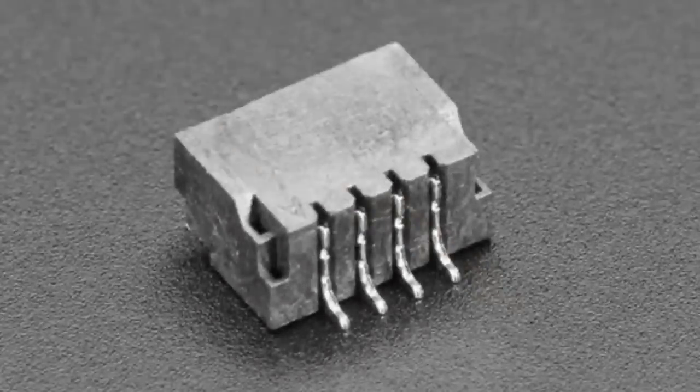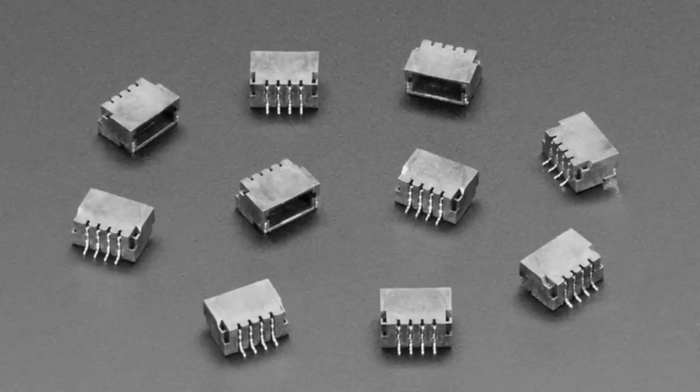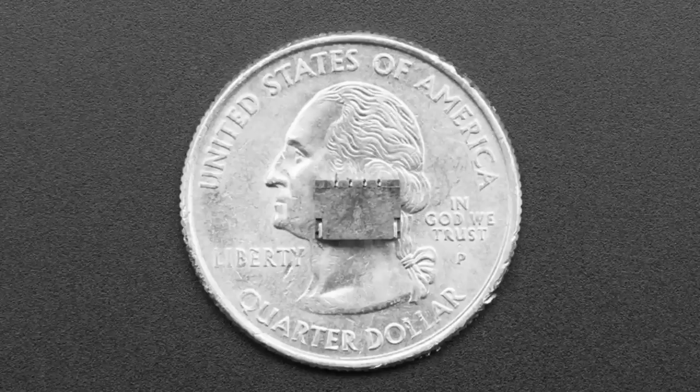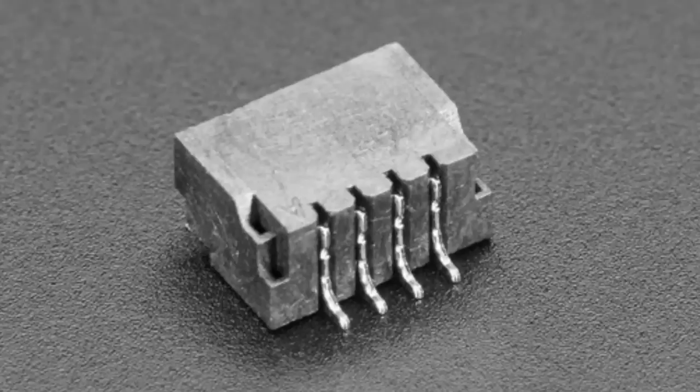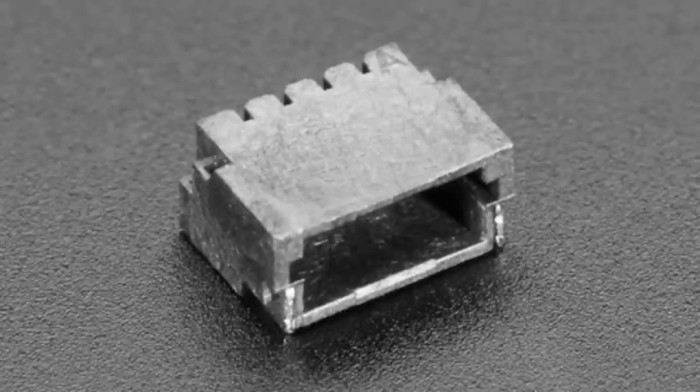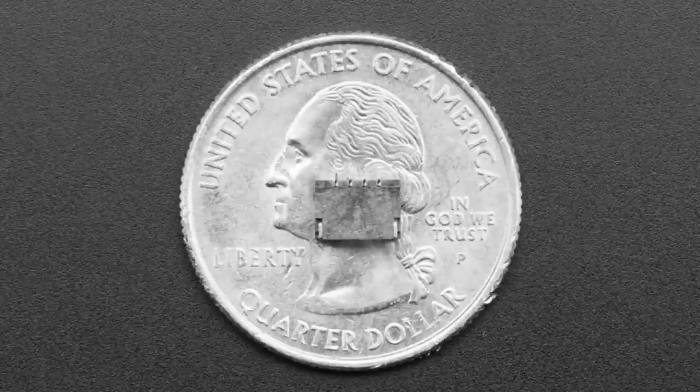Okay. All right, we got some quick connects. These are JST SH. So you might be thinking, you use JST PH a lot. These are SH. These are 1 millimeter pitch. These are used by SparkFun for their Qwiic connects, and they're handy, and we're going to make some stuff that's Qwiic compatible. So we thought, let's get these connectors in a 10-pack, mostly because I just needed them. And I'll show this on the overhead.